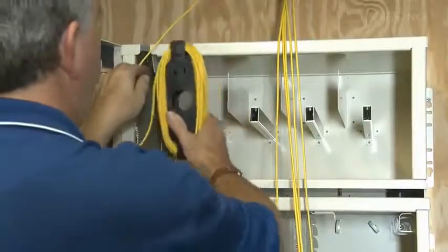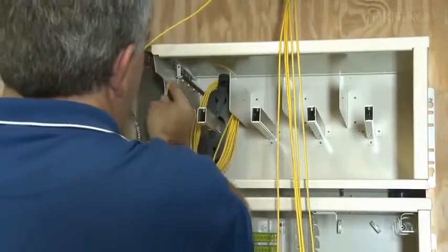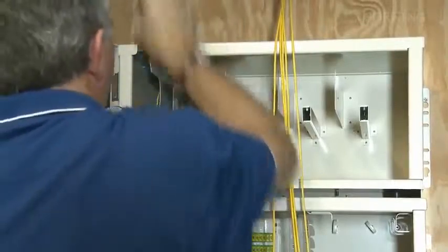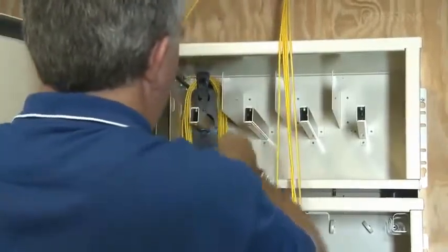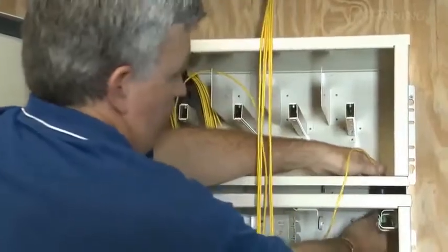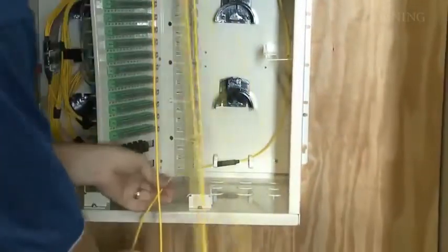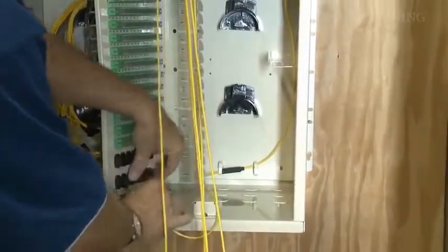Place the collapsed reel over the post in the first slot of the storage cabinet and push the reel to the rear. Next, route the cable from the conduit side over the top of the left wall and then up through the top slot of the storage cabinet. Push the cable toward the rear of the cabinet. Take the cable with the MTP connector and route it to and through the connecting tube at the bottom right end of the storage cabinet. Pull the cable into the CE cabinet and route it through the clips to the bottom rows of MTP adapters on the patch panel.